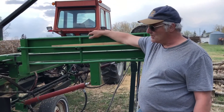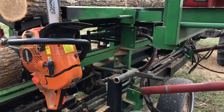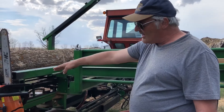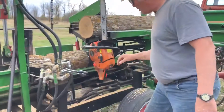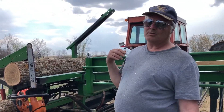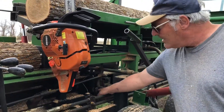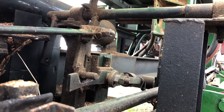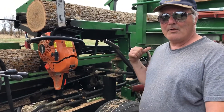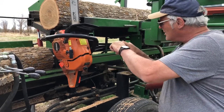This thing is semi-automatic. When I pull the lever here, it opens up the valve that operates the cylinder — the valve is way underneath — and the sled comes out, the ram comes out, catches on this rod, and pulls it back again, and when it pulls it back, the thing retracts. So I just hit it once and it does a complete cycle. The cam right here is the important part of the whole thing. When it goes down, it catches in that cam and the cylinder extends. When this rod is hit by the sled, it retracts and goes back to a neutral position — the sled hits a kick-out right there, and the kick-out puts it into neutral.